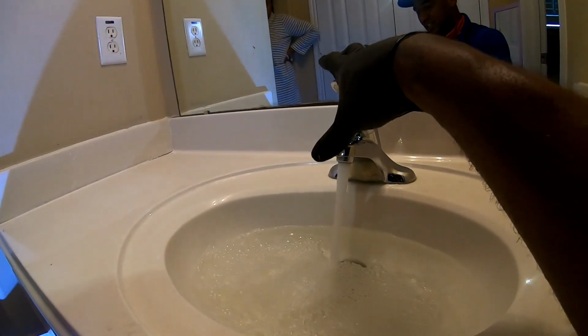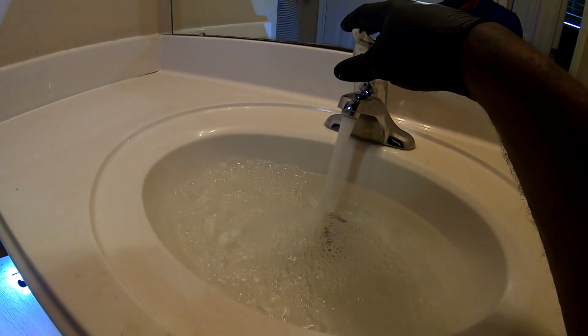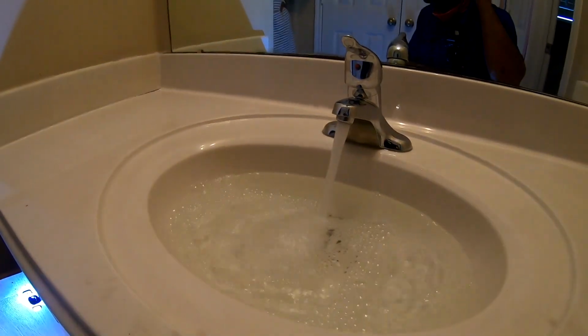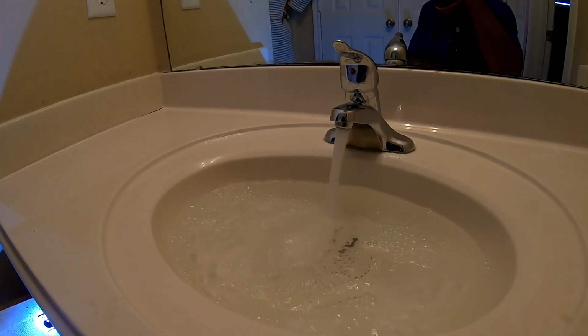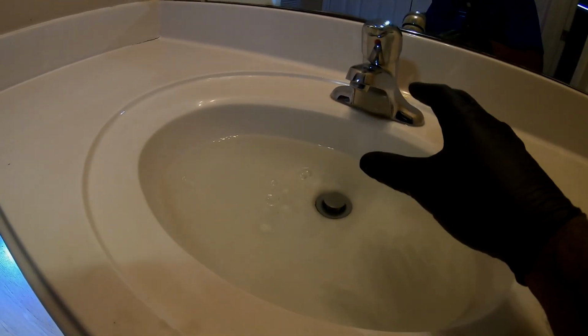So we still want to flush it a little bit with a lot of water. It needs help to flush it through because the little dirt and stuff that's going through my evaporator coil and through your filter is going to need help every now and then to just flush it through with a lot of water. I have to remember to do that because, like I say, nobody is in this room. But yeah, I think we're good to go. My AC drain and the plumbing drain were good, so okay, we're good.